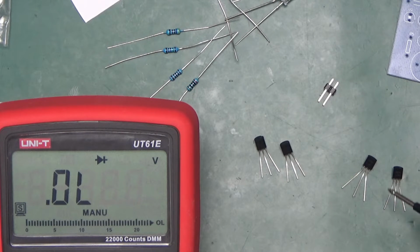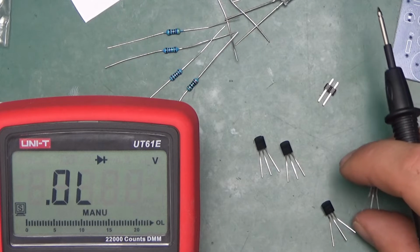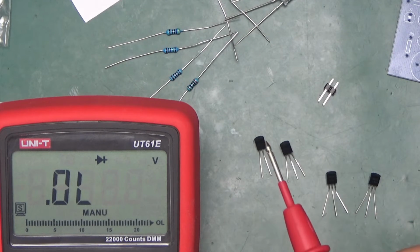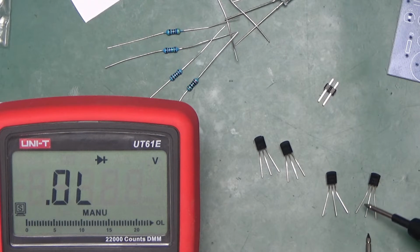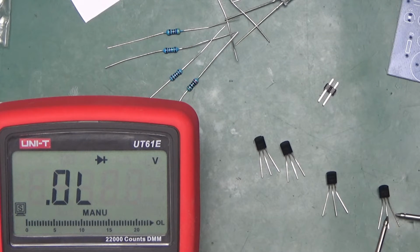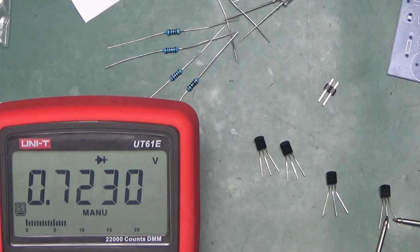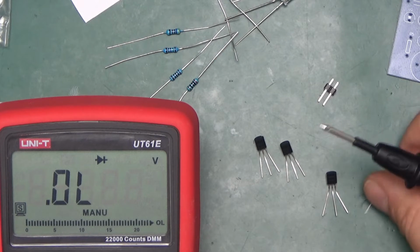Here is a quick tip on how to check if a transistor is working, or maybe the transistor is the faulty component in your circuit. So when you take your transistor out, and let's say the only thing you have is a multimeter, put it in the diode mode, or sometimes the resistance mode would work as well, but basically try to work out if you get a connection. For an NPN transistor, you should have the red lead of the multimeter on the base of the transistor, which in this case is the center one, and the black lead on either the emitter or the collector. I'm not sure which one's which in this case, I haven't checked, but as you can see, you should be getting about 0.7 volts, and that's the PN junction forward voltage. Try it in any other combination and basically you should get nothing. There shouldn't be any connection, and if that's true, you can be sure that the transistor is fine.